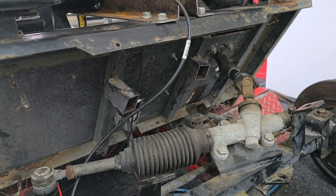We're finishing off all the small odd jobs like the lower exhaust mount. It doesn't really need one as such, but it's a great way to quickly help centralise the whole system. Being on V-bands it takes a while trying to line everything up, so we made a simple little bracket that goes in there with a rivnut and welds onto the exhaust. With the V-rod motor it's not like a normal car where you can bolt your manifold up to a hard mating surface — they always pivot and rotate because it's a motorcycle engine. So we have eight pivot points total: one, two, three, four on the mounts, two on the turbo, two on the wastegate. These mounts are more of an alignment tool so everything lines up quickly.